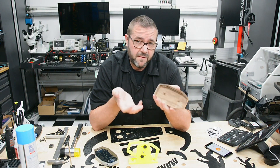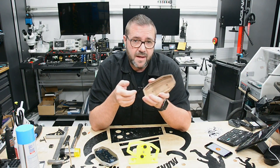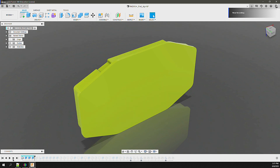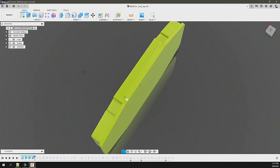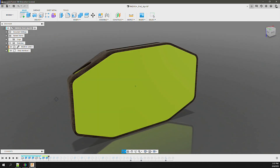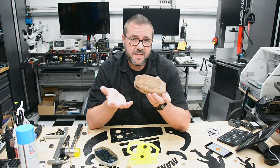I designed the body by modeling the negative space, which in this case is the perfect fit to interface with the shell of the body. The modeled negative space can help us hold the otherwise rounded object, and with a few tweaks it can be used as a body interface with room for some additional mounts. But first, how do we need to hold this part for milling?